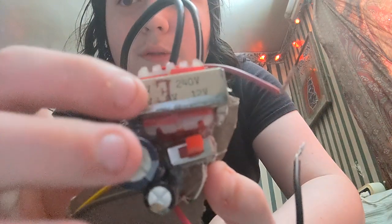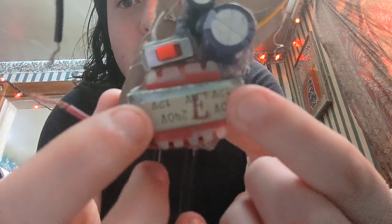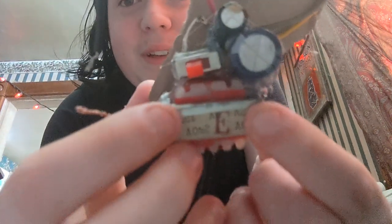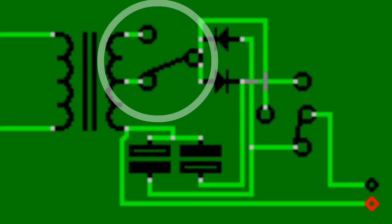I thought this was a 20-to-1 step-down transformer turning 240 volts into 12, but nope — it turns 120 into 12, so it's a 10-to-1. I thought it would give 3 or 6 volts, but no, it's 6 or 12. That's because the input isn't 240 and 240 — it's 240 and neutral, which is 120. So the output can be 12 and 12, which is 12 volts, or 12 and neutral, which is 6 volts. That's what this switch does — this is your 6 volt/12 volt switch. This is the first power supply I've had where you can switch voltage.